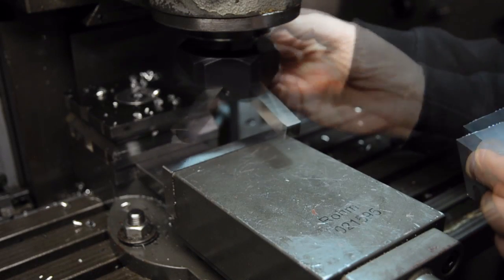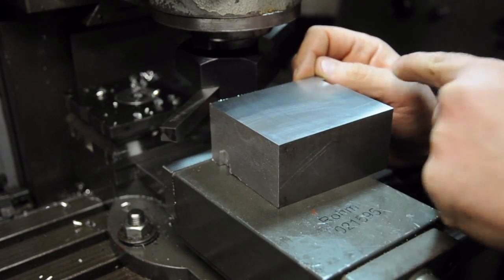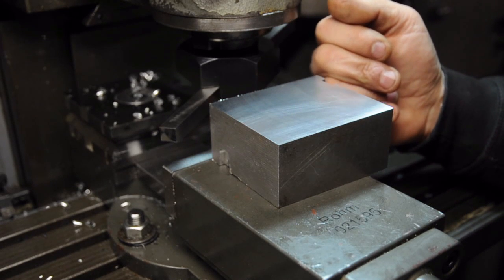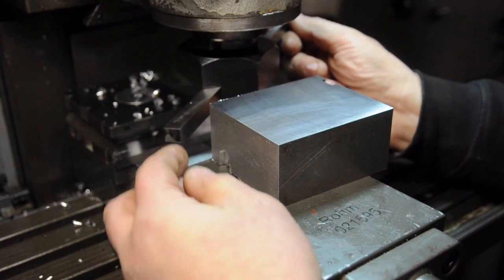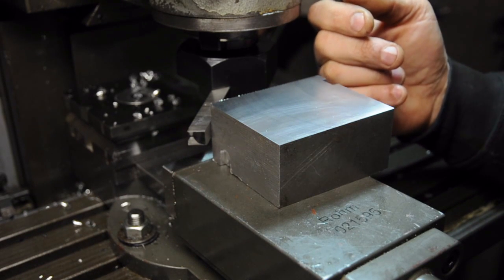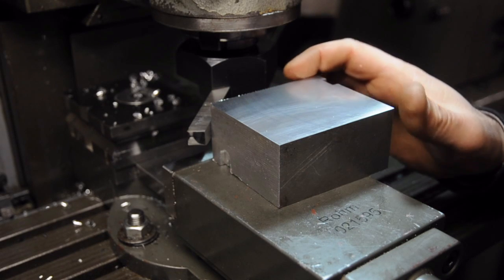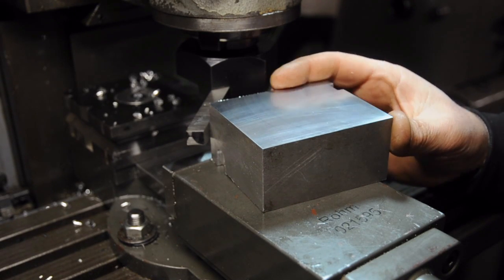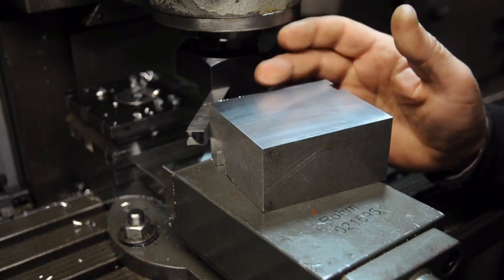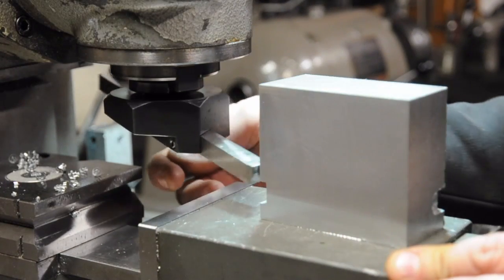Just to quickly address questions about why I built a fly cutter when I already have a face mill: I can adjust this to clear quite a wide path, a lot wider than my face mill. Being able to do it in one pass gets a more consistent surface finish - there's no break where you reverse and come back on the material. It's high speed steel, so you can grind and shape it to whatever job you have at hand. With my indexable face mill, the inserts I have are really just for steel - I'd have to spend money on a whole new pack of high rake, very sharp inserts specifically for aluminum. I think that does it for the fly cutter build. I hope you enjoyed that, thanks for watching.